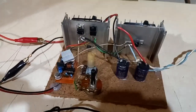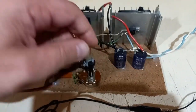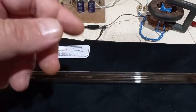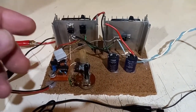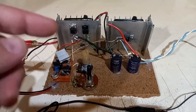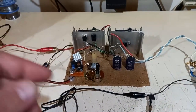You also need a driver for the flyback with adjustable frequency — in this case, I have two knobs: fine and coarse. You can't use a resonant driver for the flyback, because otherwise you'll never find the correct frequency for the standing waves. This driver is a half-bridge bootstrap design I made some time ago; you can find the schematic and some high voltage experiments in the linked video.